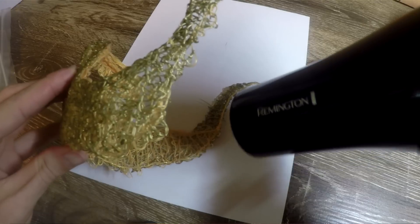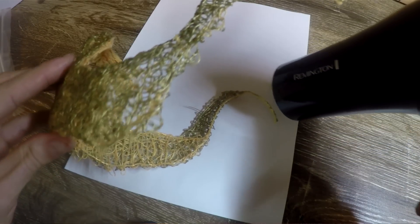One pro tip when designing parts that fit you is to use a hair dryer — like in the Hairy Lion — to soften it and then mould it to your face. As long as you don't get it too hot, you'll find it conforms really nicely and after a couple of seconds it will cool and stay exactly where you need it. This includes flexibles, so you could print rigid parts using normal PLA and then use flexible filament in your pen to join them together to make articulated joints. This heat manipulation could be used in other ways — imagine doing a long flat 2D pattern, heating it up with a hairdryer and then rolling it around something cylindrical to make it more 3-dimensional. You can also use multiple materials, like I did with the dog using ABS and PLA. Really your imagination is your only limitation.